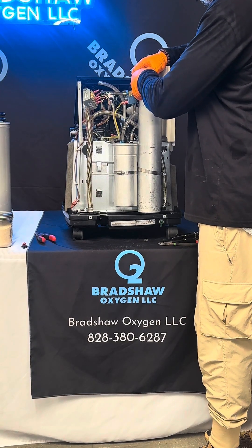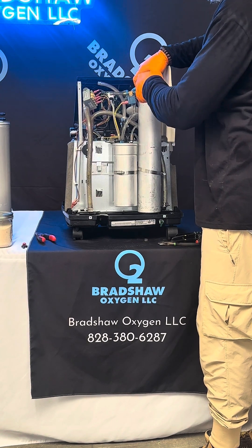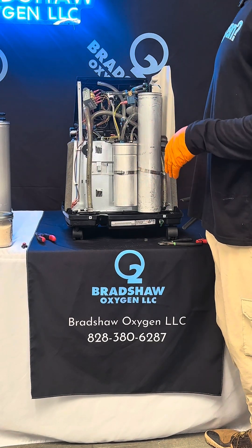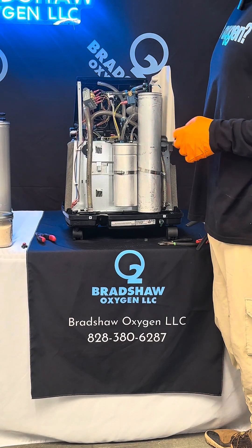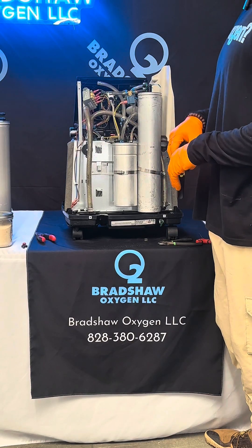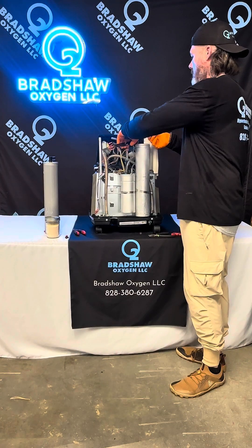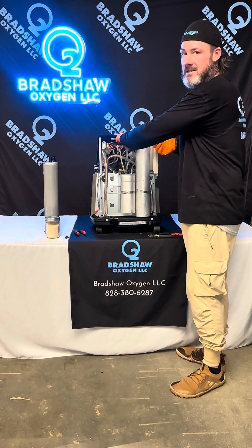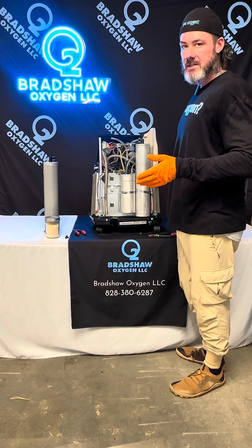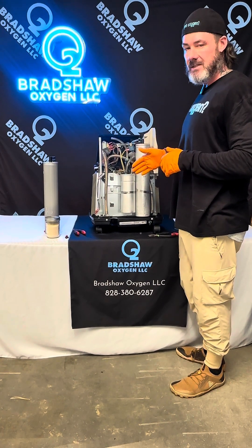I started noticing that cooked sieve material about two years ago. I did try a barrel of it, but I didn't like it because it doesn't last as long, and that's not fair to the customer. Especially if you're an artist or a patient on oxygen 24/7, you want to have the highest purity you can for as long as you can for years to come. The newer machines have oxygen sensors inside, and once that purity drops below — I believe it's 89% — you'll start to see a yellow light staying on. That's how you know it's about time to replace those sieve beds.